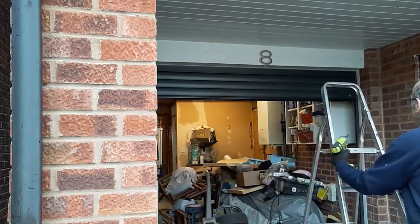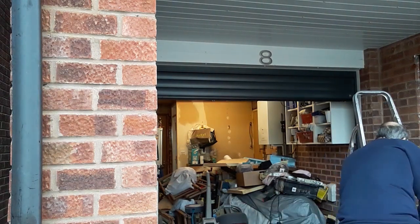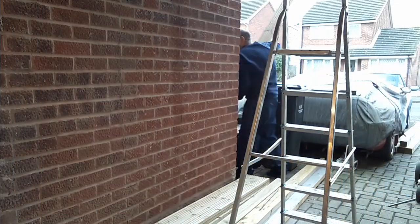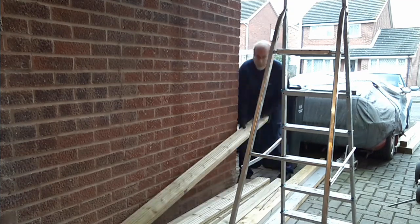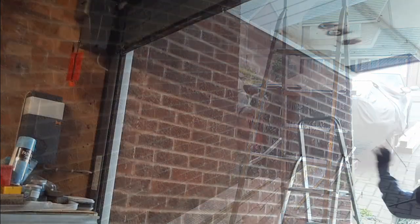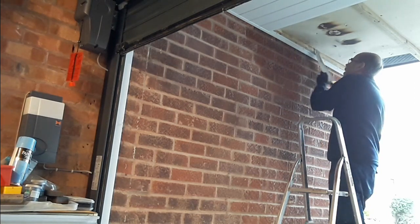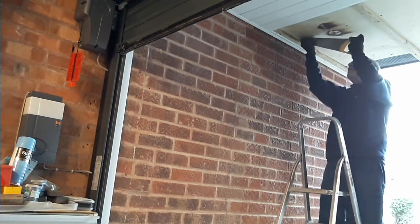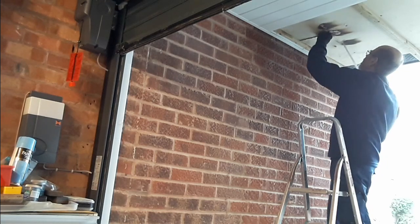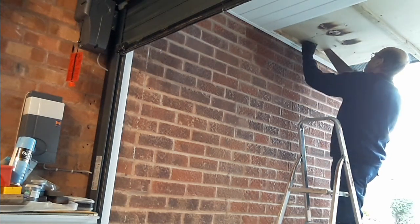I had to get on and move outside, so the first thing I needed to do was take down the ceiling that I'd only just put up about six months ago. And of course all the timber I bought in for the next project is stacked right in the way, as all of these things are. Then I just got a saw and hacked out the plasterboard that was underneath, retaining all the insulation in the floor void. And obviously that was pretty wet as well, so that's been replaced when I put it back together. But it just allowed me to get in and see.